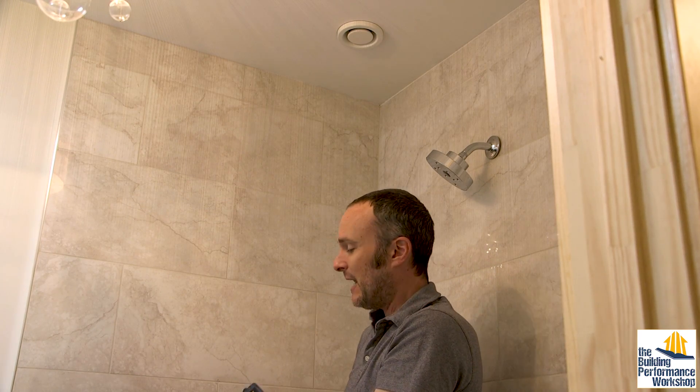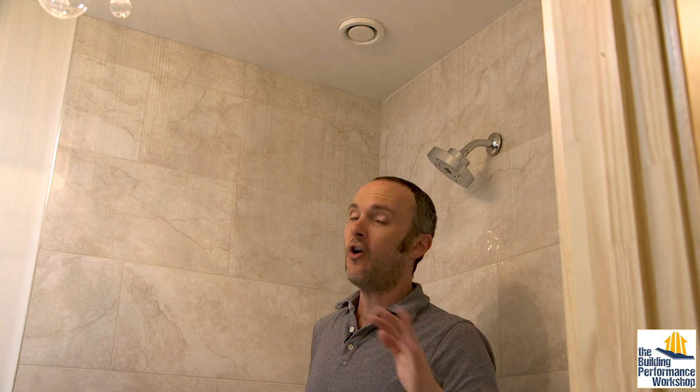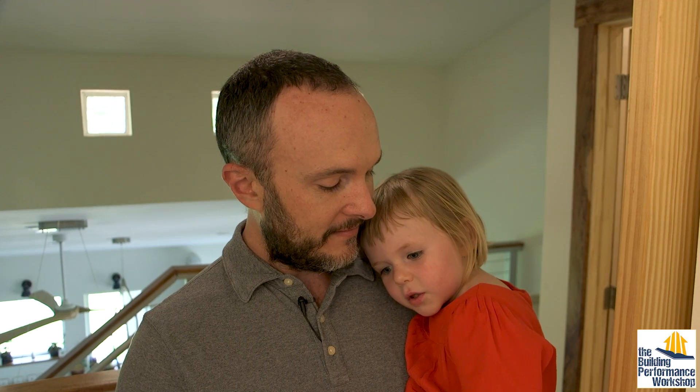In this bathroom as a whole, I'm going to have about 25 CFM continuous exhaust, which is all you really need. I'll guarantee this room will not get any condensation on surfaces — no fogged-up mirrors, no fogged-up tile. It's pretty amazing when you put these in the right place and adjust them to the right flow. I hope this makes clearer how you could begin to test ventilation equipment of all kinds. Please comment below if you have anything to add about testing ventilation devices.